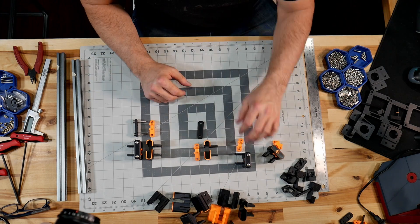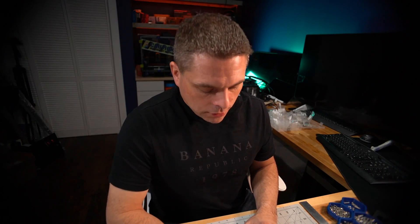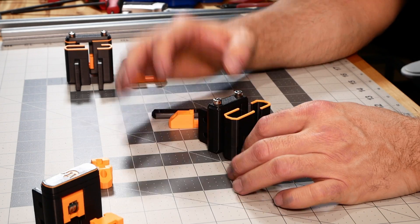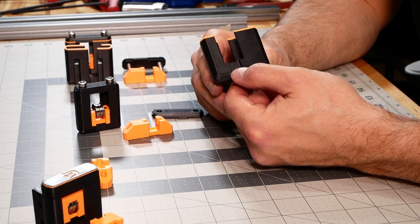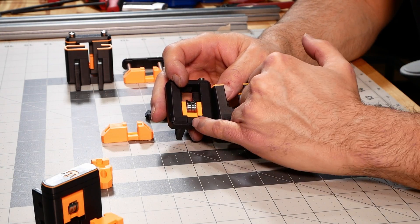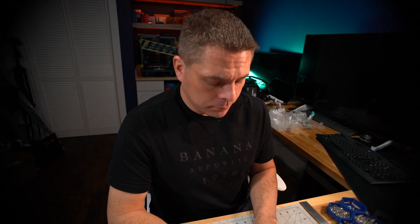Searching and having some comments in some videos, speaking with some people, I found that there is a symmetric beefy idler — this guy right here. I built quite a few of these. This is the beefy symmetric idler. Differences: it is wider because it's symmetric, meaning it's going to be the same on both sides. It's equal on both ends. But still issues — on the bottom here, for some reason, as opposed to allowing you to have this additional space to tension your belts, it was removed. Not all of it, but a fair amount was removed. So now you have less room to tension your belt. I didn't like that, but it was workable.